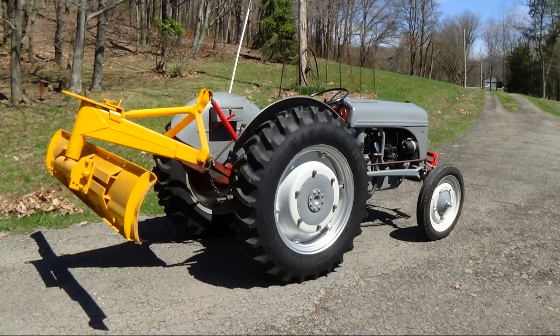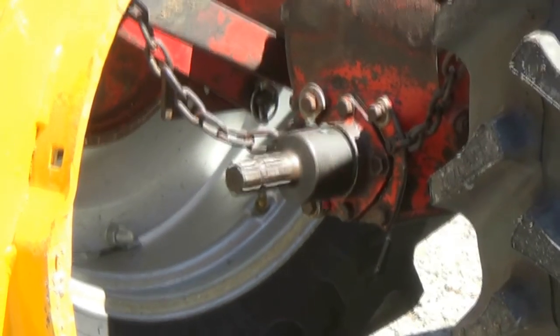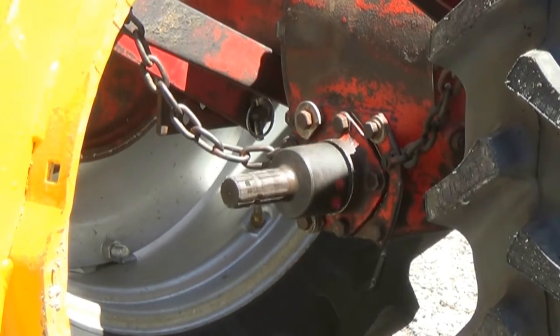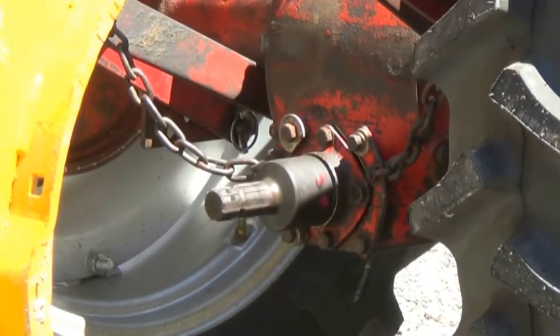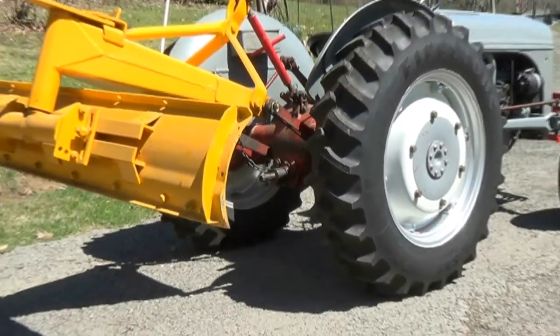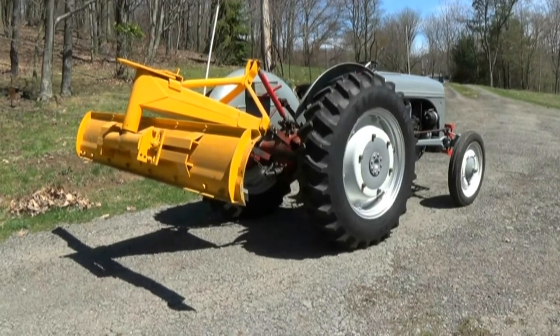I did not get it to work exactly the way I wanted to, but now I finally got around to doing it. You'll see here it is all together, and I got the plow on there for adjustment purposes. You need about 200 to 300 pounds of weight on the back when adjusting the quadrant or the lift lever of these tractors. There's the PTO going around. The 9Ns and 2Ns and 8Ns are not live hydraulics. You need the PTO in gear to move the lift system.